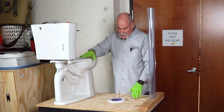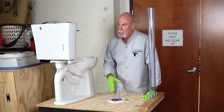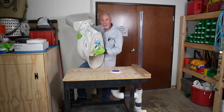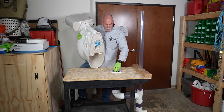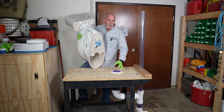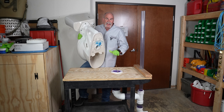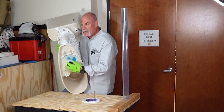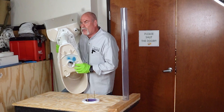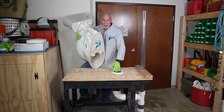With this big four inch opening here and the smaller size on the bottom of the toilet, once you put your bowl wax on, you've got plenty of room. I've actually seen some plumbers go three inch and glue a flange on the inside of that, so you do start restricting that flow path. I like the fact that with a four inch opening, it's going to be wide open and the chance of having a blockage — you've pretty much eliminated it.